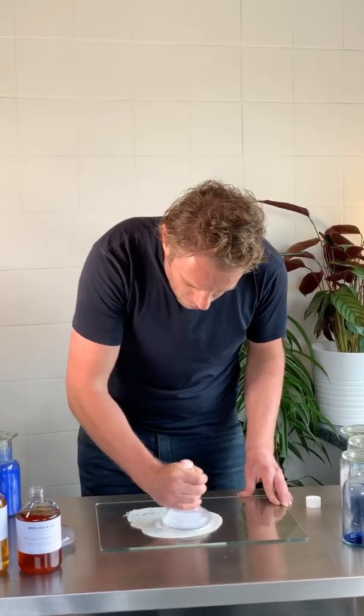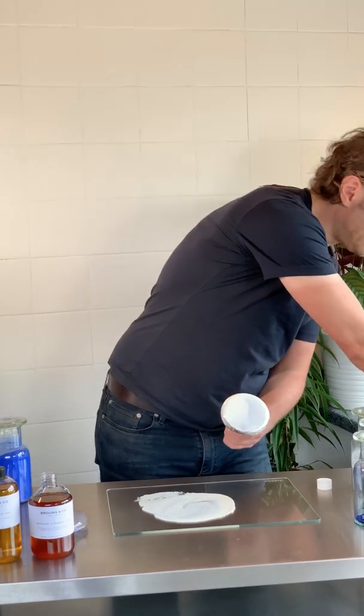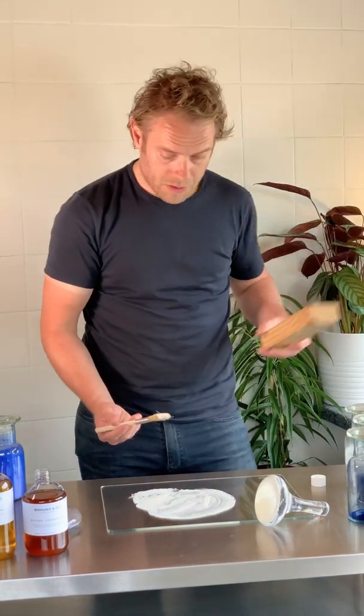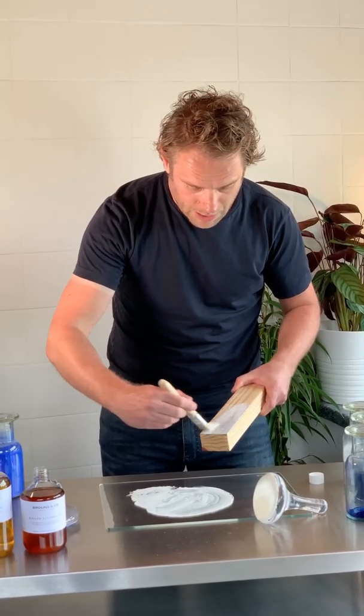Once this has been really properly ground, you're looking for a really perfectly smooth consistency — which we already have. This is essentially it. We can get a brush and a little bit of paint on the brush. You've really not made an awful lot of paint, but it doesn't need much and it can go straight onto the timber. What I've got here is perhaps a little bit light on the pigmentation, so we could always add a little bit more pigment to get a slightly thicker consistency — but this is essentially it. That's linseed paint.